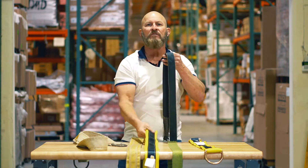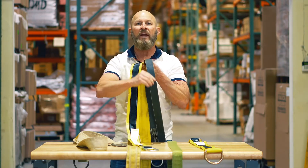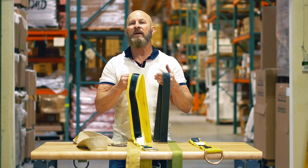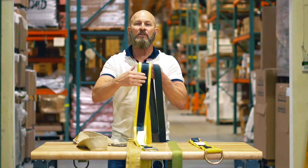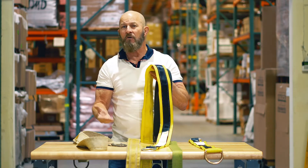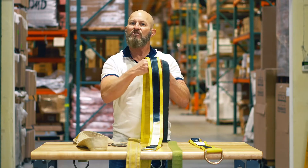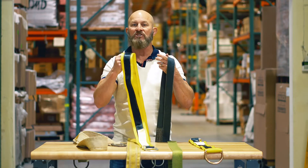You will also notice that there is a difference between the way these look. This one here is a single strand of material with no wear pad. When I sell these units, I recommend my customers buy the premium brand. This particular beam strap has a wear pad on the bottom — this would go on the abrasive material, the hot material, or the wood, wherever it's going to contact — and then the load component is at the top. So the wear is on the bottom, the load is on the top. These will last much longer.